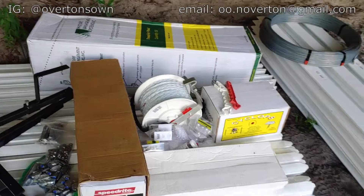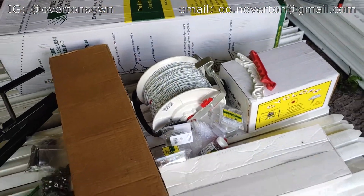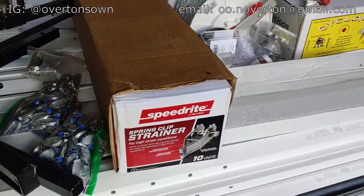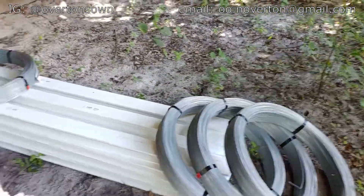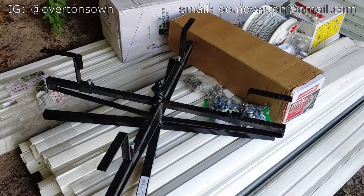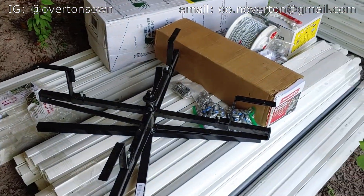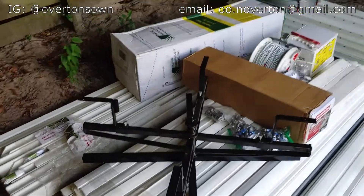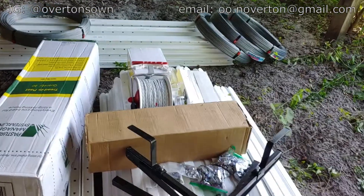So we picked up a whole bunch of T-posts, got a Terragate 3-to-1 reel with a bunch of polybraid on it, got our Energizer there — Cyclops — got the Daisy tensioners so that we can keep that high tensile wire nice and tight as we stretch it around, got enough supplies to make some A-braces, got this Spinning Jenny where the high tensile wire sits on top, and then as we run it provides just enough friction but controls the spool so that we don't let it get out of control. A bunch of step-in posts, and then obviously a bunch of hardware.